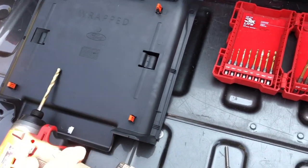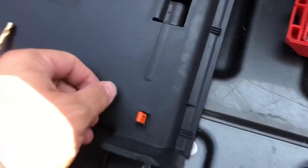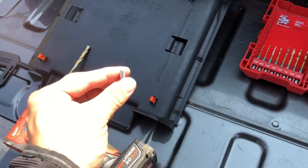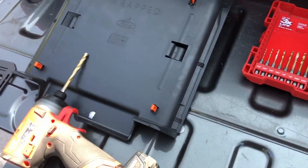I'm going to use a quarter-inch drill bit and drill from the back side of the panel, which I've got marked. That quarter-inch hole is going to give us plenty of size to get a number 12 machine screw in there with some room for fine adjustment. So I'm going to go ahead and do that now.